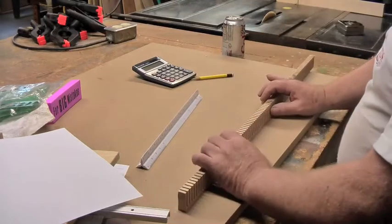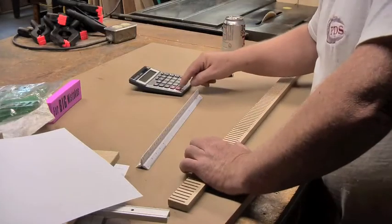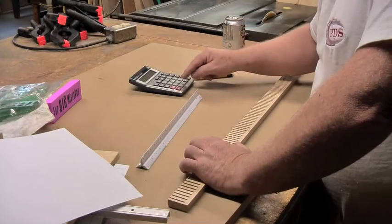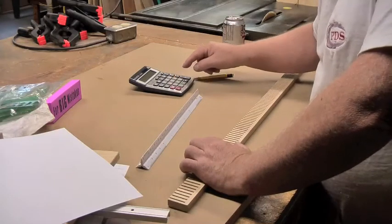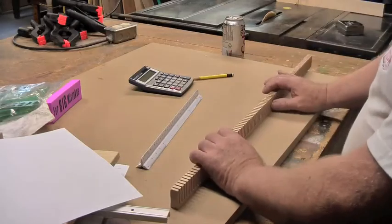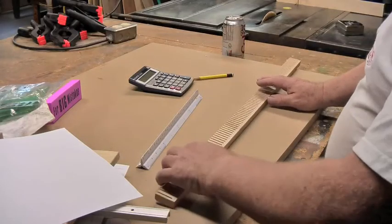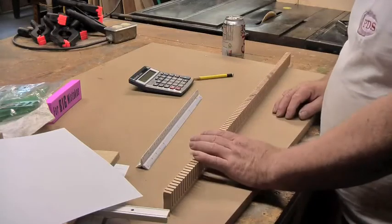And we'll put that around a piece of MDF, 28 5/8, say 28 1/2. Should give us a ring approximately 9 inches. So I'm going to get the veneer, I'm going to iron it on here, and we'll see how that turns out.